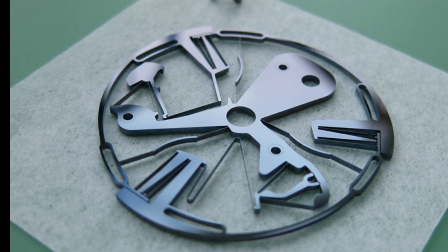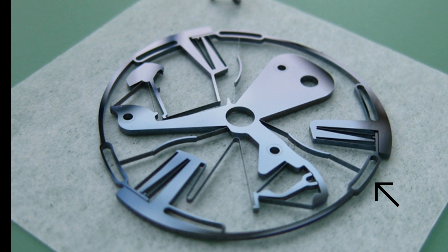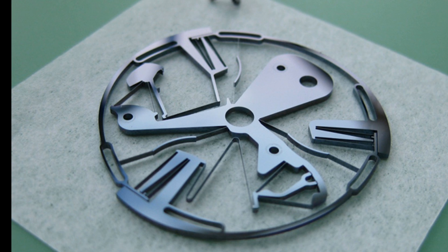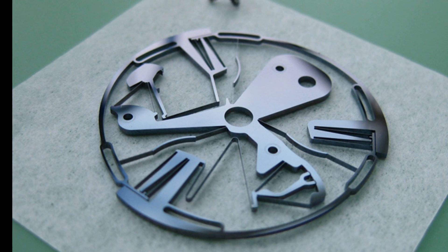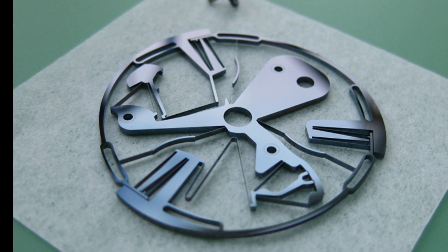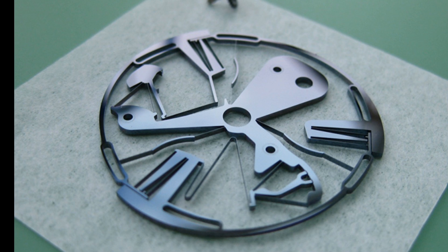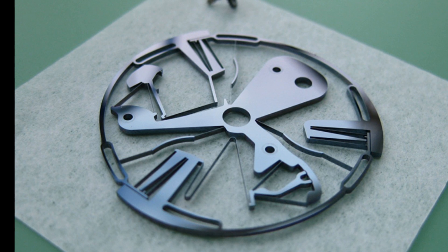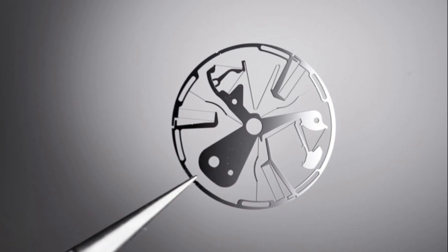Shocks are also mitigated by six slots placed along the external circular sections of this piece, through which pins sit, and there is also a cage around this. These allow this piece to be sandwiched between parts and held in place by those pins, which allow the piece to still oscillate but prevent any vertical knocks — perpendicular to the movement — from affecting the height of this piece, as due to its quite large size it would be susceptible to bouncing up and down. This component is a really incredible departure from tradition, with the lever of the lever escapement integrated into this single component, with no joint or pivot of its own.